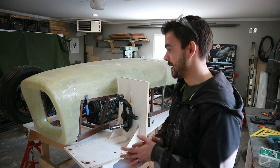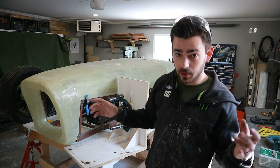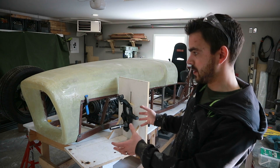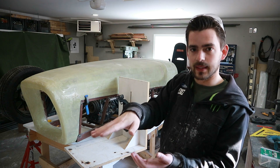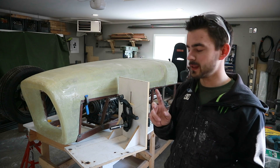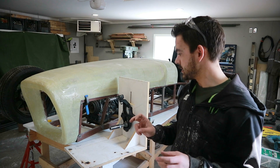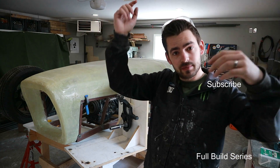So I'm not going to do that today — I don't want to start moving stuff around while the cowl is still wet. That's where we're going to call the episode. We got the jig done and we can arrange it where we need it. Next episode we'll pull the motor, jack the chassis up, get an idea of the trajectory of those A-arms, and then we can start building those. I also need to pick up some 5/8 bolts because the heim joints on the bottom A-arm take 5/8s. Thank you so much for watching — like and subscribe, we'll see you next week!